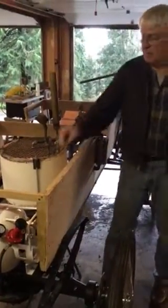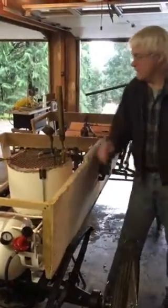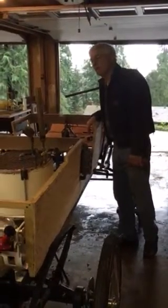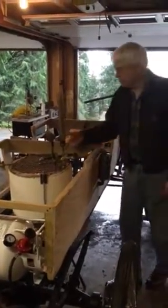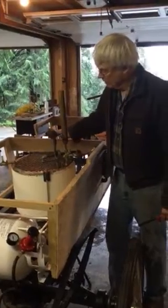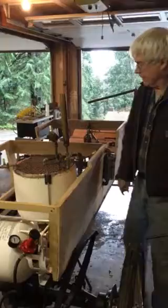The pressure is up just a little bit here. I don't have to do it quite so hot. I have no feed water yet. I have to use a hose to build pressure in the boiler. But anyway, 350 tubes. There's heat coming out of here. That's going to go sweeping up the flue or plenum this way, over here, and then up through an exhaust right there. I had a lot of work to do.